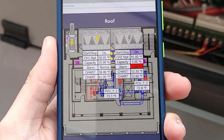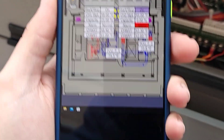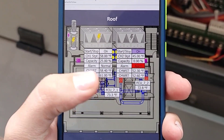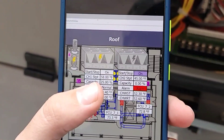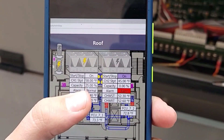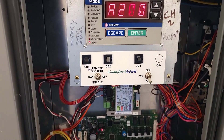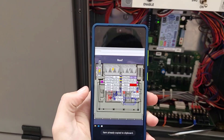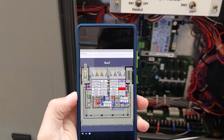I went in and I enabled the chiller, and I've got Teams here where I can log in remotely and I can control it from here, reset it. Right now you see the purple — I've got it commanded into an on, and I lowered the chilled water setpoint just to force it on, because they've got it running like 58 to maintain the building, which is fine. It's really cool out; they don't really need much cooling. This chiller is set up to control the pump itself.